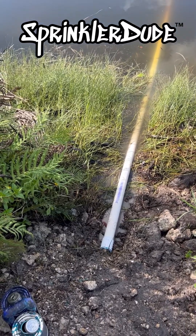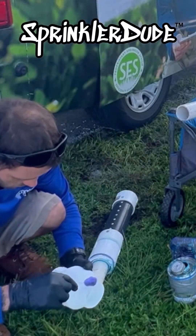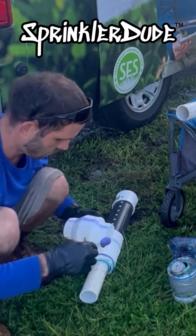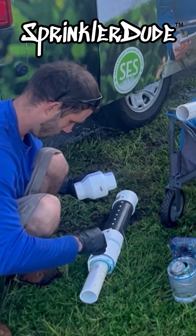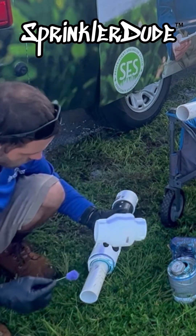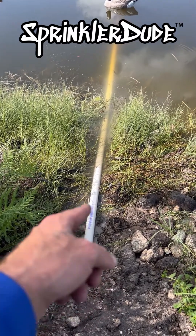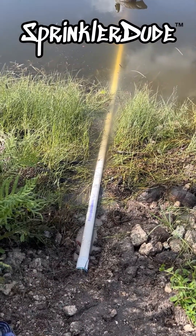You see that little purple line on the top of the pipe? It follows the red writing on the pipe. Earlier in the video I also painted a line on the top of the check valve. This is a swing check valve, so we want to make sure that when it's installed horizontally the swing portion is on the top. I painted the top of the check valve so it's easy to see which side is up, then followed that with the red writing on the pipe so I could see down on this end where the top was, and at the very end I painted a little line here so when I made my final connection I could just look over my shoulder and know that it's pointed up.